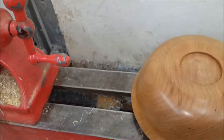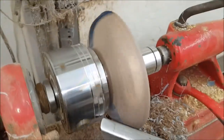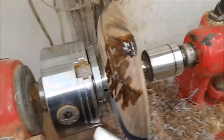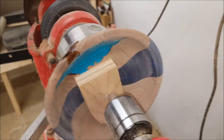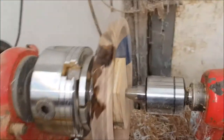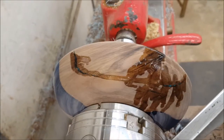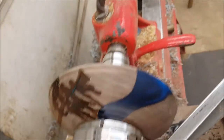I was playing with resin and I tried this resin bowl with a river-type thing through it. It was actually turning out pretty good. I was happy with it until I got to some cracks that were down inside the wood and then it warped it. I mixed a little pearl powder into the CA glue and then forced it in here to try and unwarp it. I'm going to leave it and let it sit — hopefully that'll keep it from doing that. I filled the back side up where the cracks, from me pushing it together, opened up on the back side.